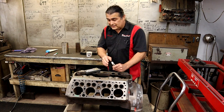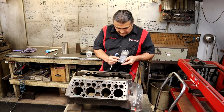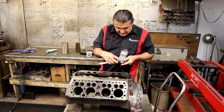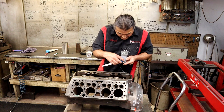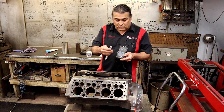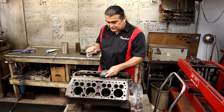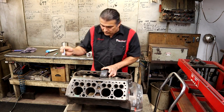We're going to calibrate it and set it. There's a calibration point right on it that you can see — we can actually calibrate it and test our numbers. There we are: 198. It's supposed to be 197 to 198 — we're right on the money. We're using a gel on the cylinder and we're actually going to sit in here and see how thick the cylinder is.